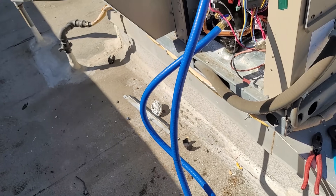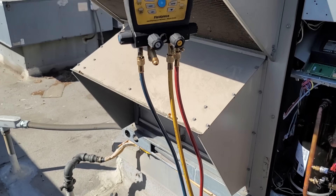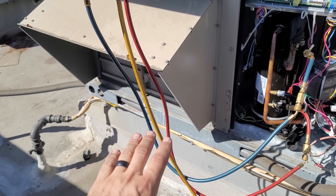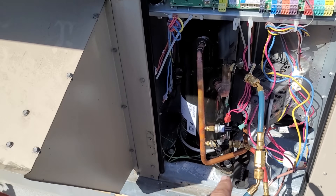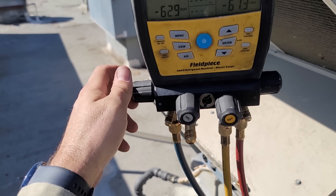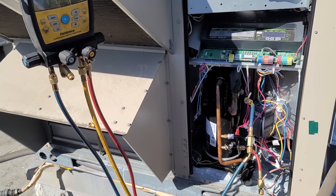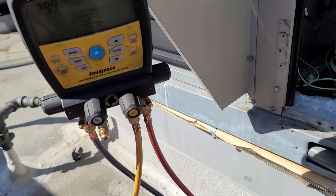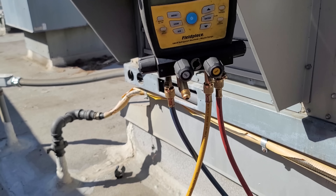793 microns — we're going to call this one a pass. It's been about 10 minutes. I'm going to go ahead and hook up my gauges and evacuate the gauges real quick so we can do a unit charge. I'm about to charge with my manifold, but my manifold is not in a vacuum. I don't want to pull all the moisture and air from my manifold hoses into the system, so I'm going to evacuate the manifold before I open these ball valves. The entire manifold is going to be evacuated — I'll get it down to a good level and then fill it with refrigerant.